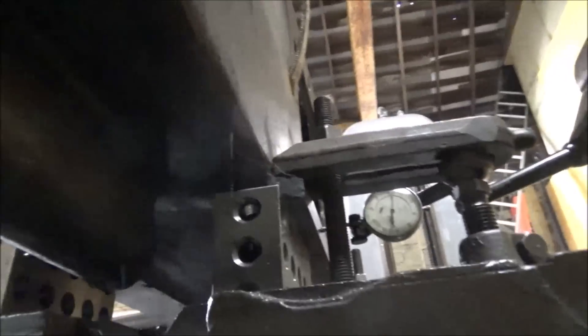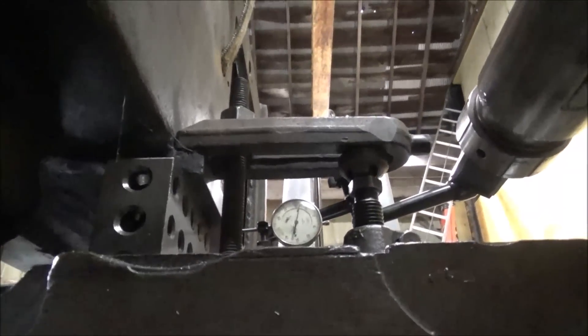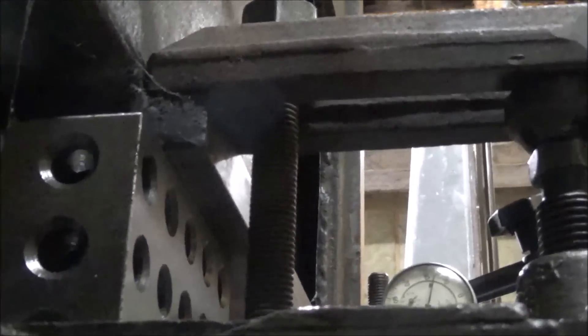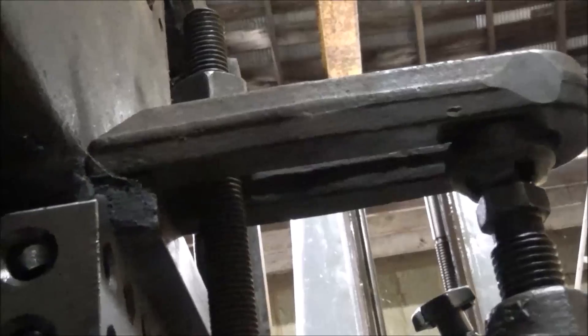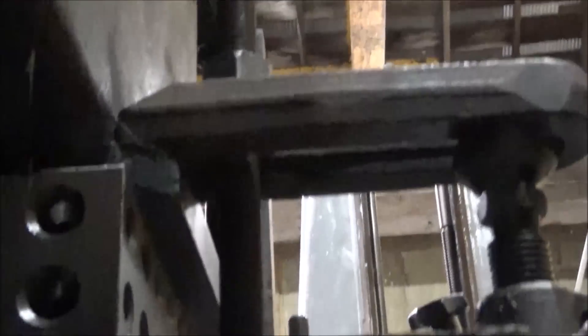Showing 83.4 there or something like that. I'm going to say that looks pretty good right there. I can barely see it, but I think I'm pretty straight. So I'm going to get a milling cutter in here and we'll see if we can't knock this bottom flat.